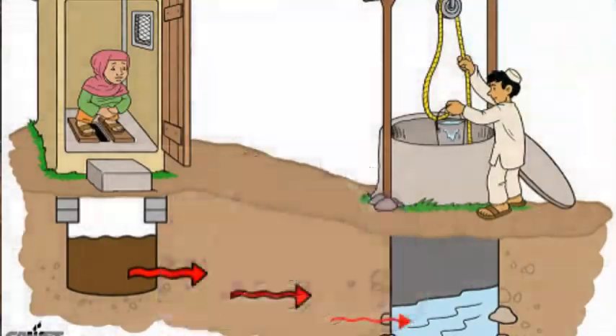Another thing to look at inside the well log is what the soil layers are. If you've got gravel or sand all the way down, water can travel outside the casing all the way down to where the pump is, and you'll be getting nasty, unfiltered, unprotected water. You want tighter soils — preferably clay, but silts or finer materials that make it harder for water to travel from the contaminated surface down to the well.